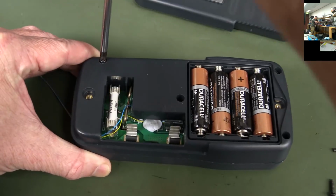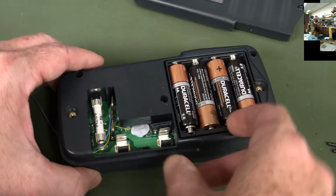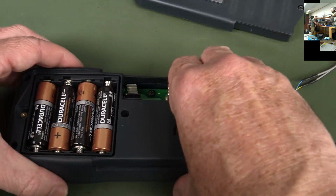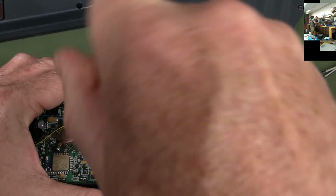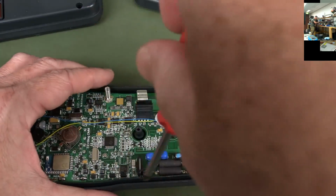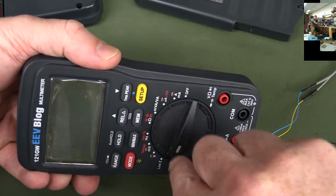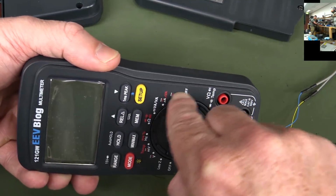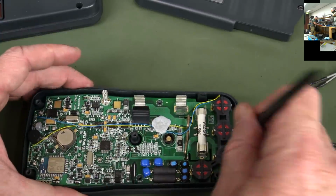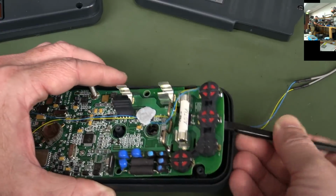We were getting roughly about 2 ohms contact resistance towards the end of that. So it was still going good. One cycle is from one off position to the next. It's not cycled all the way back. So one cycle is from here over to here, and to go back would be 2 cycles. That's how we're counting, just how our jig works.